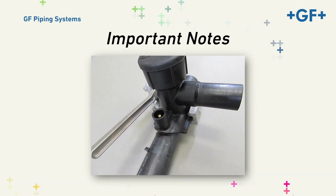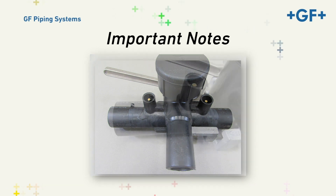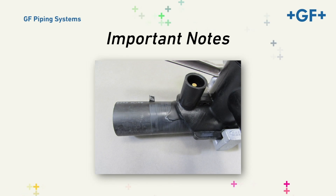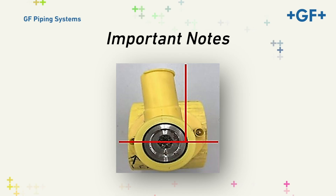To work properly, the clamping forces must be distributed in accordance with the manufacturer's design. If a clamp is off-center, it will not deliver the appropriate forces. Note that when a saddle clamp is applied in favor of either end of the fitting, the high side of the fitting may lose the molten plastics because its cold zone is not in appropriate contact with the pipe. Finally, the most frequent mistake we see in clamping occurs when the operator fuses the service main to an EF high volume tapping tee before fusing the fitting to the main, and fails to neutralize the torque on the outlet during the fusion and cooling period. We recommend installing the Electrofusion high volume tapping tee to the main and letting it fully cool before installing the service main to the outlet.